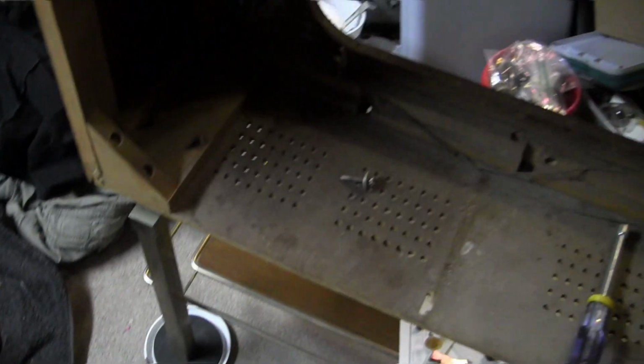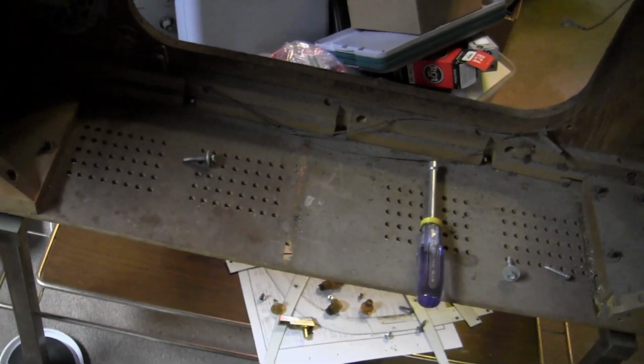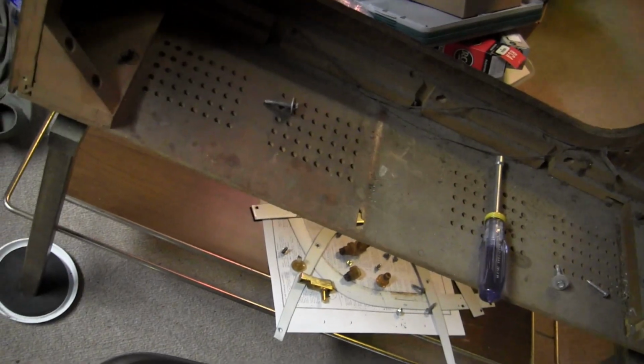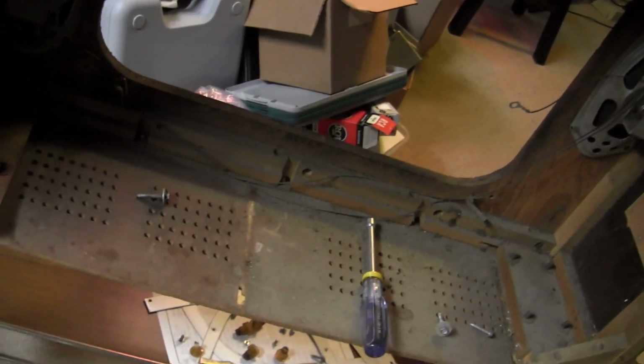Of course, we want to be super careful because of the fluorescent tube running around inside. But now I can go to town and completely clean this out to my heart's content. I'll vacuum it out, clean the picture tube thoroughly all around the sides, and see about reattaching the grill cloth that's separated in some areas in the front.